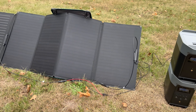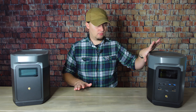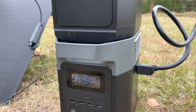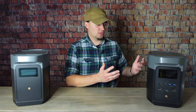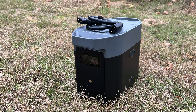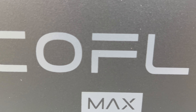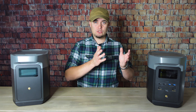Getting into expandable power stations — a good example is the EcoFlow Delta 2. When you have an expandable power station, you have the unit as normal but you can also get extra batteries to hook up to it and increase its capacity. By itself, the Delta 2 can store around 1024 watt hours. But with a Delta 2 extra battery you can expand to 2048 watt hours, or with a Delta Max extra battery you can expand it to 3040 watt hours. With the original Delta you get a little more capacity up front, but you're stuck with what you have. With something like this, you can purchase what you can now and then build out a more powerful system over time.